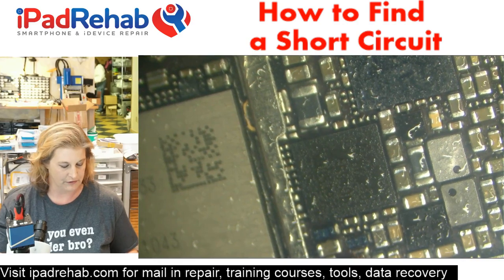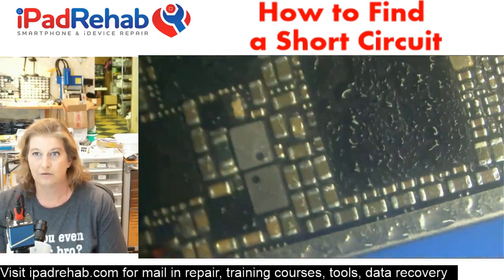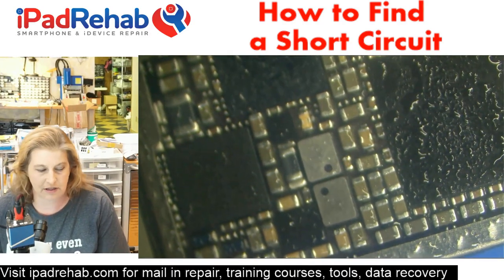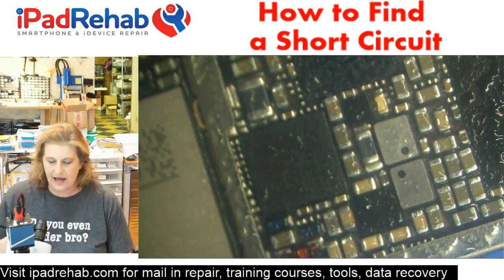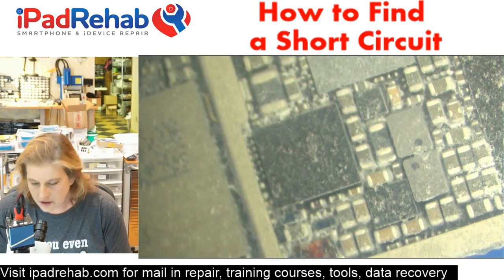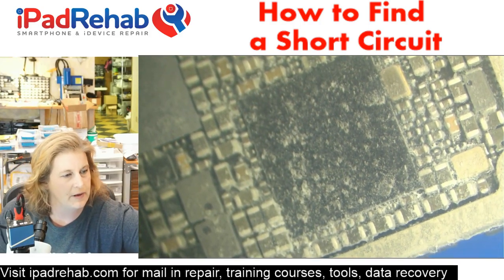So here's how we're going to proceed. We are going to use the little factoid that we just found, which was that we saw a very specific spot of heat right here. In fact, I'm going to do that one more time so that we can put a tweezer on it and know exactly what we're talking about. All right, so here we go. We're going to look right at the PMIC and plug this back in.